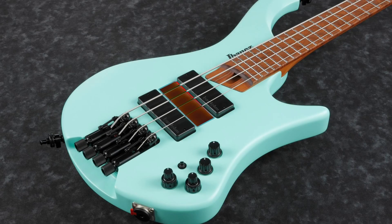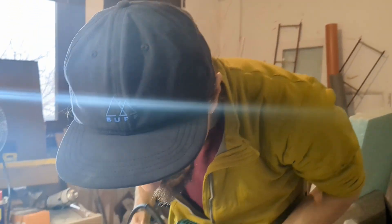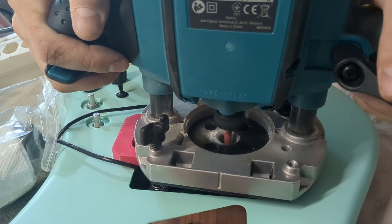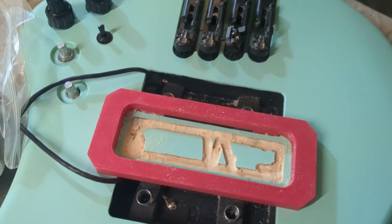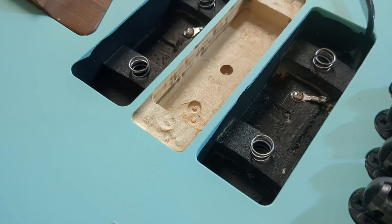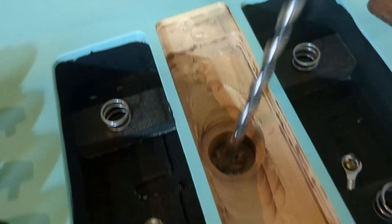For the body of the guitar, I'm going to respectfully tear it a new pickup slot here in the middle. You're starting to see how the gorgeous black aluminium cover plays in. Then I drilled a large hole through the whole body and cut the channel on the back to run a hose towards the edge of the guitar body where it doesn't sit against my body. I got myself a brand new manual router mill that I'll learn how to use live while doing it — best way to learn, they say. I used a plastic-depositing CNC to build some jigs first, then manually followed those jigs. It turned out pretty neatly for the first time. Drilling was a bit scrappier but I got there eventually.